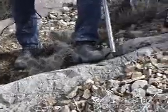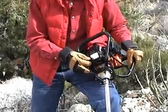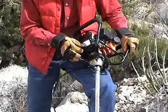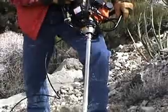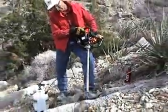Over on the side, easy to reach, there's a little water valve that controls the flow. The thing you want to do is not burn the diamond bit — you don't want it to get dry, because it will heat up and damage the bit. If you keep your water flow just so your cuttings are coming out at a buttermilk consistency, you'll be fine. This is what I'm going to start out at — this is plenty of water.